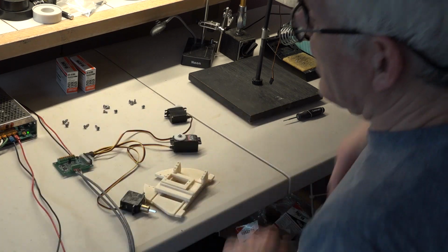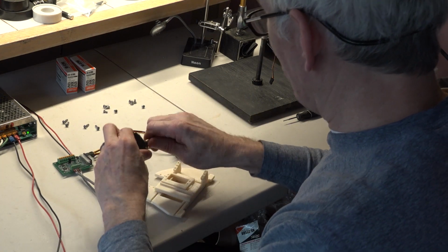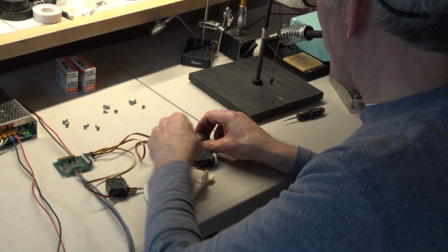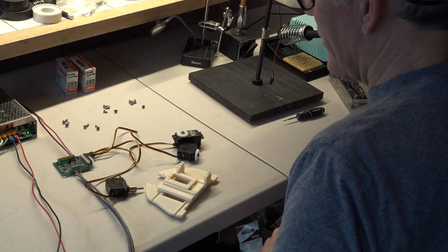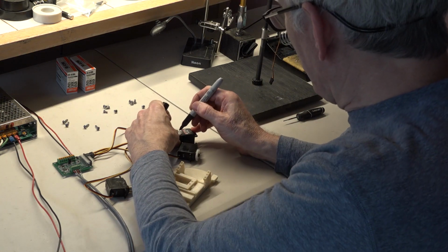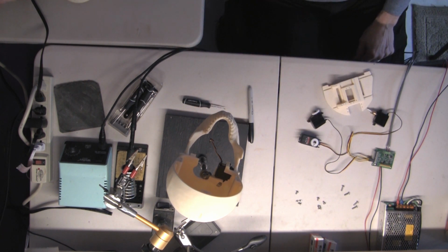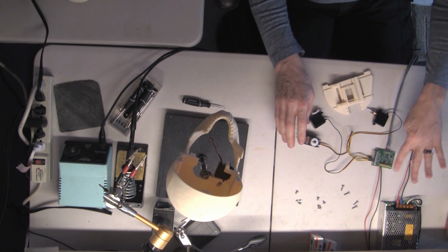And you'll see the little green light there come on. Now we're powered up. My servos are powered up, and they have all centered. They were pretty much in the center to begin with, so you didn't really see a big move, but I can show you on one of them. I'll power that off, and wait for it to power down. Now I'll take this servo here, make a little mark on it so you can see where it is, and now I'm going to turn it so it's way off. Now when I turn on the power supply again, you'll see that it's going to center itself. And there you go. So that's why we have to do this.